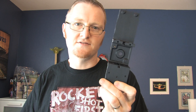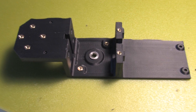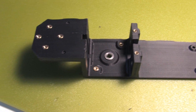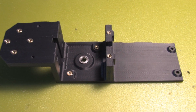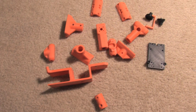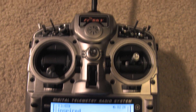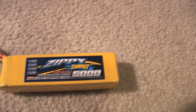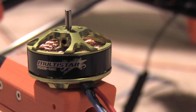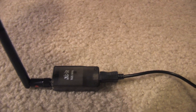Hopefully the bearing will fit in there — but I already checked. It doesn't just fall in, so that's good; I'll just need to trim it down a little and force it. Here is the new frame with the brass threaded inserts installed as well as the bearing for the landing gear, servo, and threaded rod. Here are some of the parts that I've broken or had to replace since this project started. Here's the Taranis radio we're going to be using, and we got a 5,000mAh 4S battery from Hobby King, as well as these particular motors, which will hopefully do the job. And here is the radio I got directly from 3D Robotics.